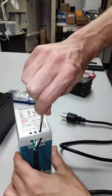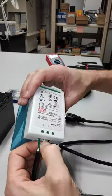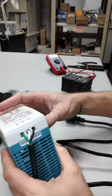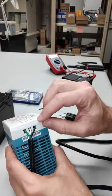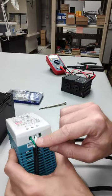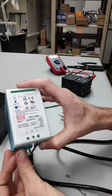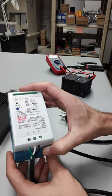You will want to make sure to double check each of those — just give them a good little tug and make sure they're not coming back. We don't want any of our exposed soldering tin or the copper wires coming out of here. We want the insulation for each of the colored lines going out so we can still match it: green to ground, white to neutral, and black to live.